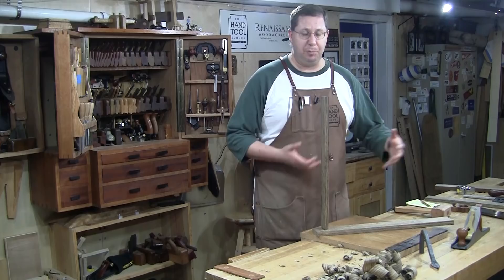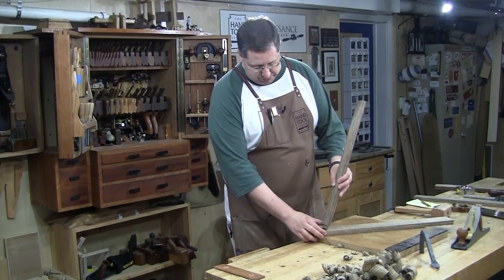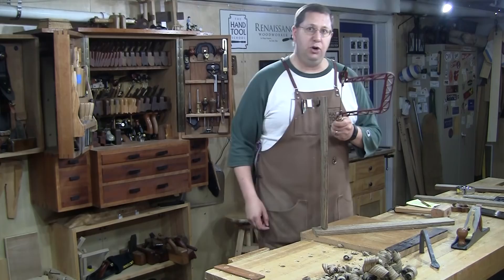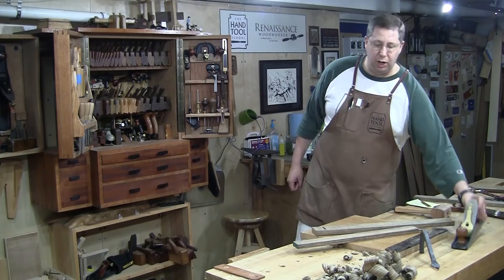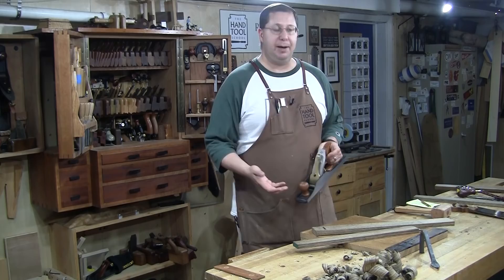If you really wanted to get fancy, you could even shape a curve. I've set this back about a half an inch from the front — grab my coping saw and use a flexible strip or just kind of freehand out a curve, and use the coping saw to cut that curve in. Now refining a curve can be a little bit difficult with this minimal set of tools. You can certainly grab a rasp or a file to firm that up, or just grab some sandpaper to clean up the saw edge. You can also use a jack plane to plane a convex edge — it requires some really good feel of the blade and a nice light cut, but you can plane your way over and clean up that convex edge. If nothing else, clean it up enough that coming back with maybe some 180-grit sandpaper will be enough to finish the job.